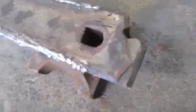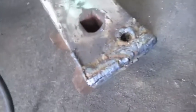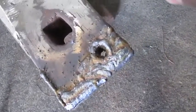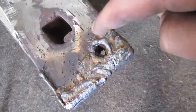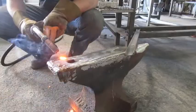I am going to fill in that corner there, and I used a bunch of scrap pieces. I tried to leave a little bit of hole there so it could still be used as a pritchel. You can see the little pieces there that I had used — I'm just going to cut those off later. Here you can see that I squared it up and made a nice square heel, and I made sure the top was all nice and flat, raised higher so that it could be ground down.